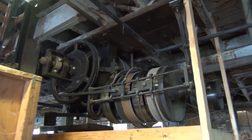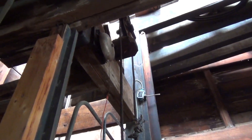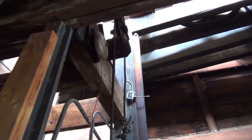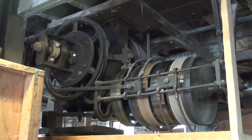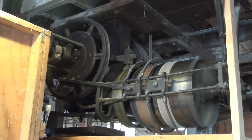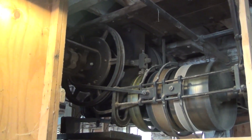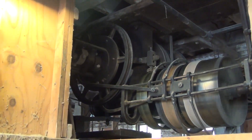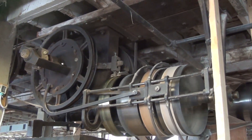That twisted belt allows the wheels on the drive system to turn in opposite directions, as shown here. Once the motor is powered on and spooled up all the way, the elevator is ready to be used. To control the elevator, there is a set of cables in the shaft. Pulling on the ropes turns a wheel and slides the moving belts onto the wheel in between the already moving wheels. The center wheel is connected to the main drive shaft, and there's also a brake connected to the main drive shaft which is set and released automatically.